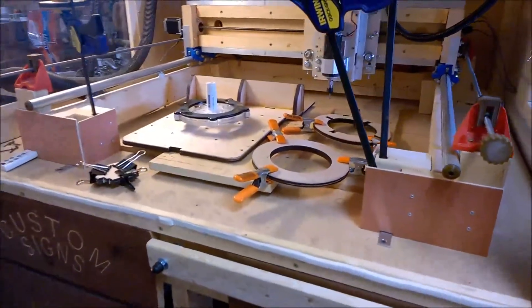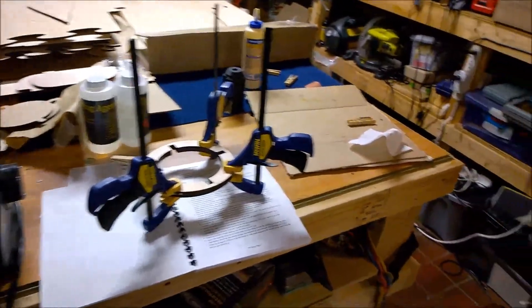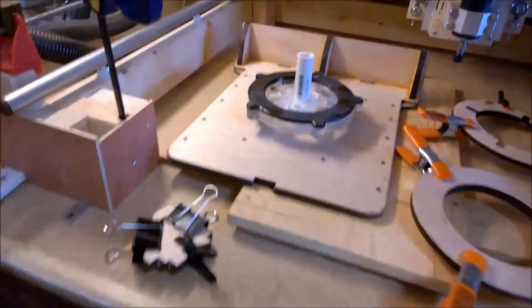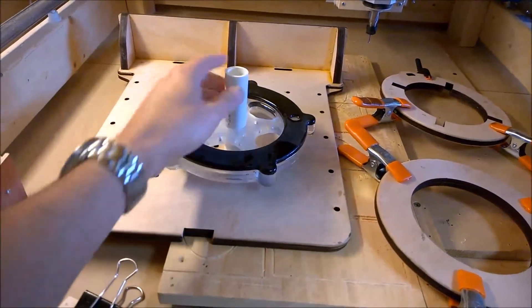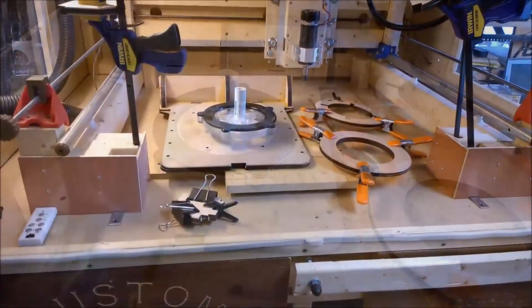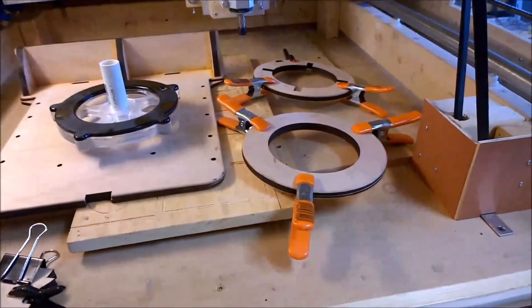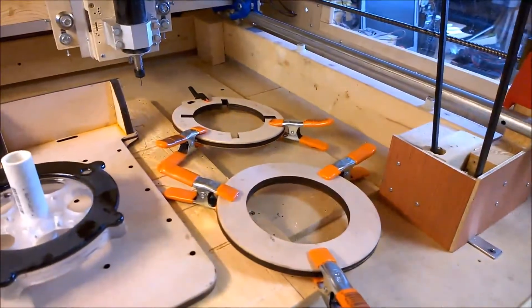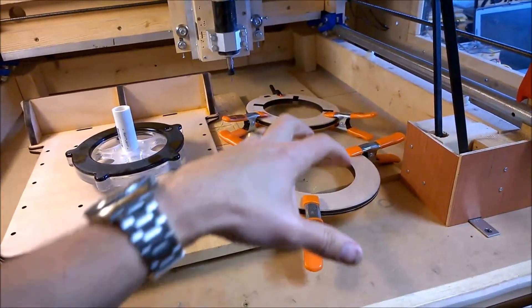I went through my clamp pile and everything is held together nice and tight. Binder clips are another option. This is just wood glued together with Titebond. Last night I finished up the mount for the seat as well as the glue-up for the steering wheel. A quick tip for gluing wood pieces together: what you can use to keep pieces from sliding around is a little pinch of salt in the glue — that gives it something to crunch down on, and then as the clips go on it won't move around.